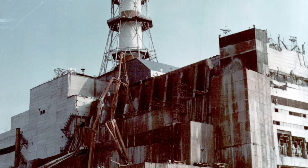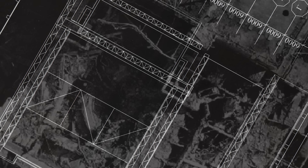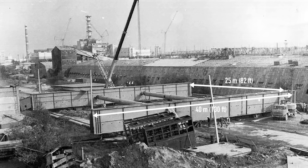At the top of the Cascade Wall was installed the Northern Counterforce Wall. Like other elements, it was assembled from hollow segments which were filled with concrete only after positioning. The next step was to restore the roof over the reactor. This required installing supports to hold massive beams, including the main beam known as the Plane. The Plane consisted of two beams, each 40 meters or 130 feet long, secured 25 meters or 82 feet apart with a pipe system. Together with its straps, it weighed an incredible 177 tons.